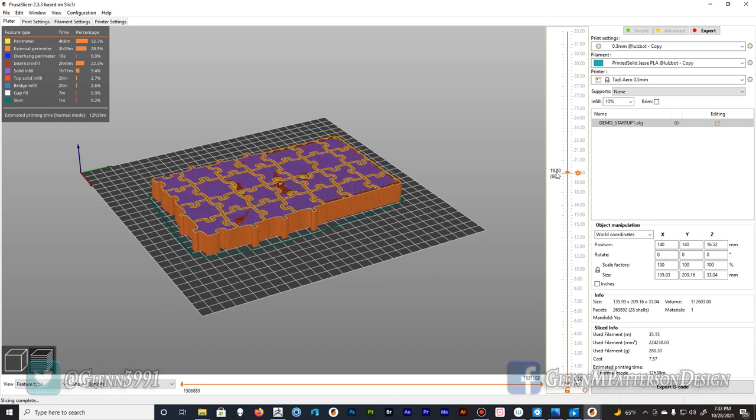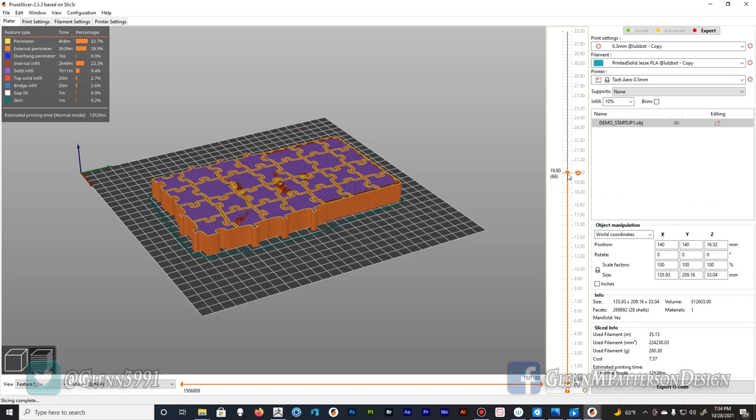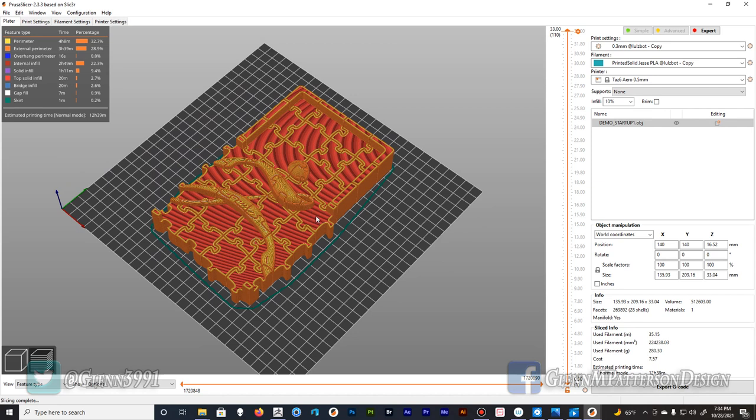And what I would do is set it up, from here down, to do 0.3 layer height. You can change it to where it starts at a lower resolution, at a 0.2 or 0.15 or whatever, however low your Z height can go. I haven't ever done it before, but you can. And then start there at the lower resolution. So this way you get a little more fidelity off of the important sections, which is your top face and your sculpt on the inside.